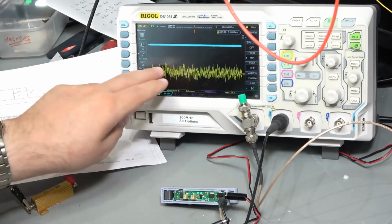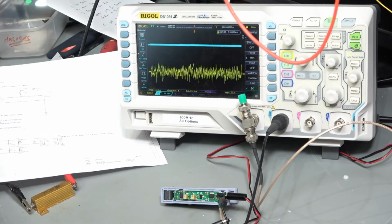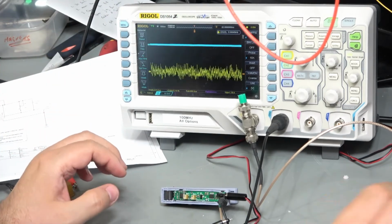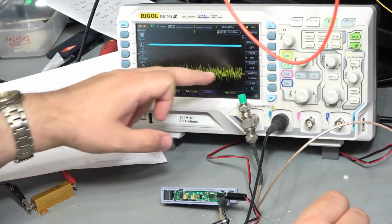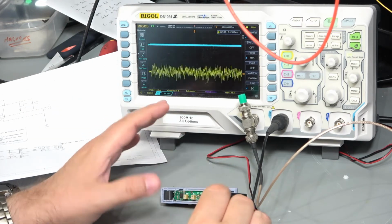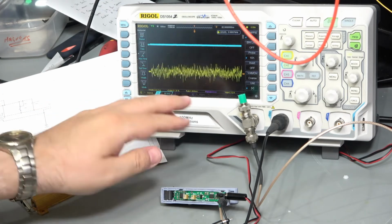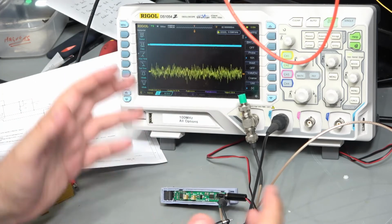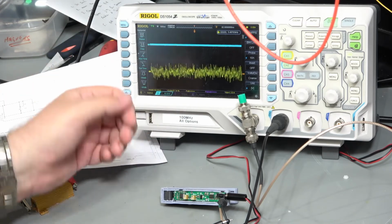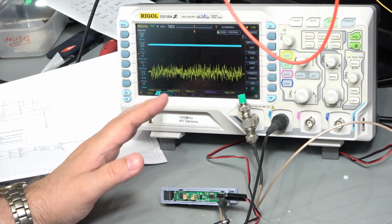And although we could put some high frequency filtering on that, which is essentially what's happening when it's plugged into the multimeter. Yeah, so the multimeter is working, but perhaps the source of its instability is all this noise. So where's this noise coming from? Now my immediate thought was, oh, I've built an unstable op-amp circuit, and since it's going into a 1 meg input on here, it's seeing it as capacitive and it's all unstable, so I've terminated with 50 ohms. It's obviously reduced in magnitude slightly, but basically it's still unstable, and that was kind of my first thought.